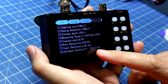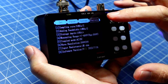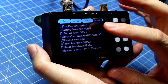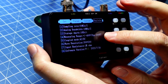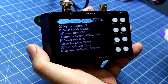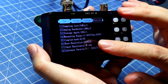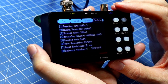The About screen confirms: 50 mega sample rate, 10 megahertz bandwidth, 10 kilopoint record length, 400 volts input with X10 probe giving 800 VPP. As mentioned, in X10 mode this is very important — it is not for measuring in X1. AC and DC coupling. Screen resolution is 320×240. It is a 3.8-inch screen — quite a large screen for this form factor.